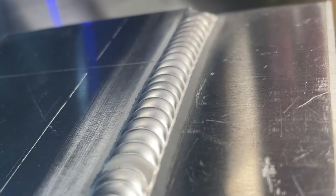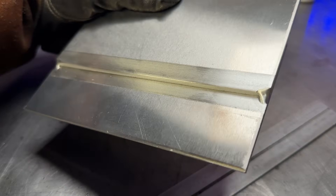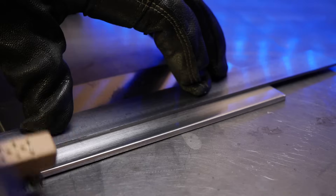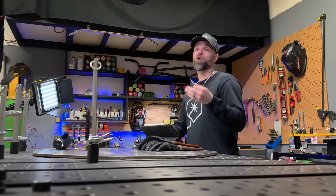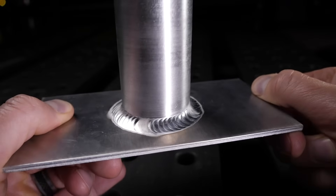In my programs, we start out by scribing a line on the bottom plate. This does not have to be exactly where the edge of the welding area is going to be — it's literally just a reference we're going to check in with as we weld. With this joint, it's really easy to get lost and lose the bottom line, and this helps you to stay on track. I also teach students to do this with fillet joints where gravity is fighting you on one side. You can even do this around curved or round shapes — scribing a rough bottom line around the bottom of a pipe fillet gives you something to check in with clearly as you are welding, and it helps maintain consistency all the way around.